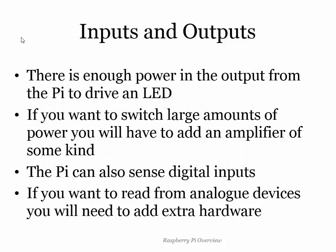The kind of power you can get from these pins will light an LED and not do much else. But you can control relays with the pins, so you can turn on quite large devices should you wish. You can read inputs as well. If you want to read variable voltages as opposed to on/off states, then extra hardware is required. There's a really astonishingly good-value analog shield you can get to put on top of your Pi which gives you very high quality audio capture, among other things.